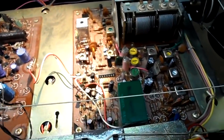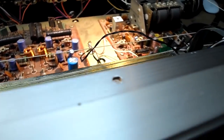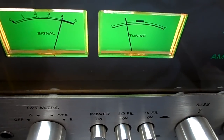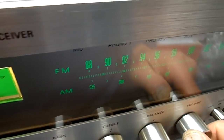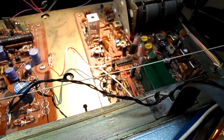No reverse polarities — everything is correct — but I've thrown the FM off. I have no stereo light. When I shut it off it'll come on and go out. The mute — it's real touchy — the mute control which was noisy before — this is awful, it's just a mess. The signal meter is working but it's not tuning well at all. AM is still there, just muting stations horribly, and I've done nothing wrong.